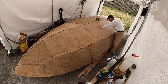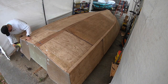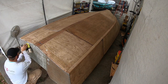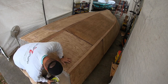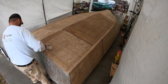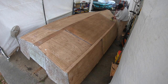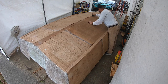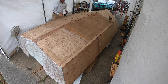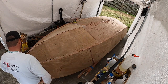Because I'm going to come back in there - all these gaps and holes - everything under glass will have thickened epoxy packed into it, so it will be one solid unit with the epoxy and the wood from the inside. That's all sealed so there won't be any voids anywhere intentionally. You can see that's where the through-hull fittings will come through right there on each side. The keel pad, and also right there where all my scarves are, there's obviously epoxy in there - I'm using about a 40 or 60 grit pad on that random orbital just to rough it all up.